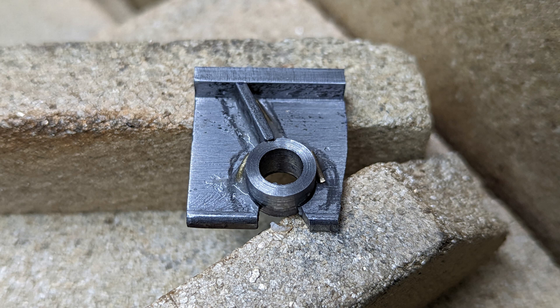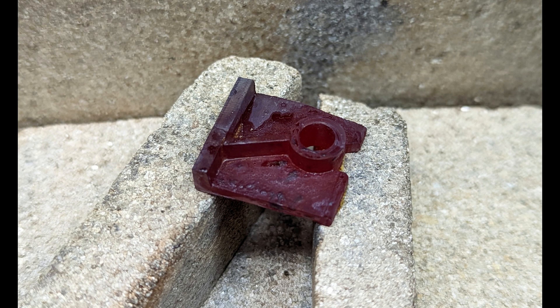I've also put a little notch in the boss to help locate the rib. After applying some flux paste to the joints, I've added some small bits of silver solder which hopefully will flow nicely into the joints. Another thing worth noting is how I've placed the workpiece on vermiculite blocks — I've done it this way so that I can apply heat from underneath and hopefully avoid blowing those little bits of solder off. It would appear from this picture, taken just after I'd heated the part and the solder had flowed, that I've been quite successful. You can just make out the solder joint between the parts.